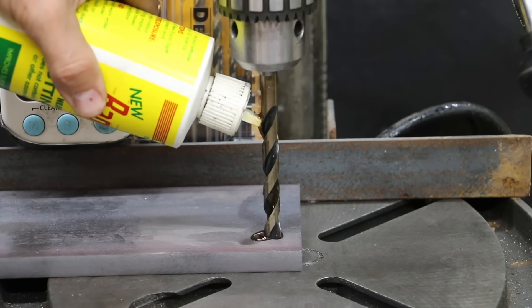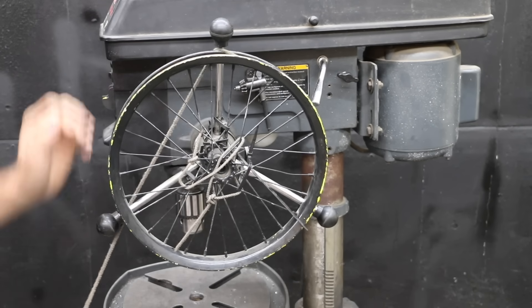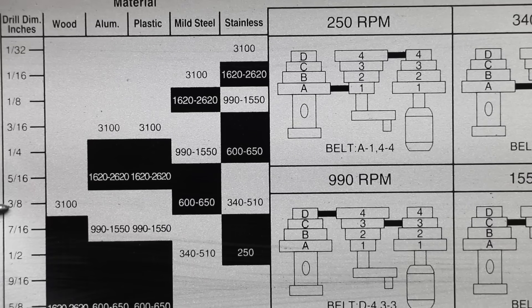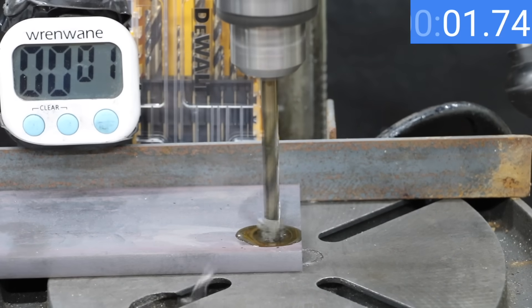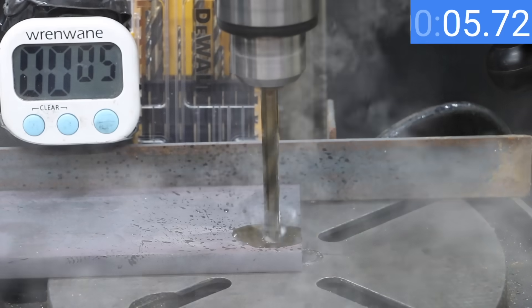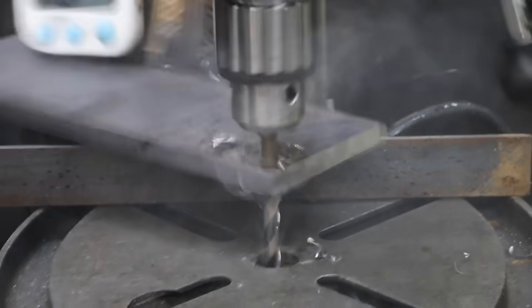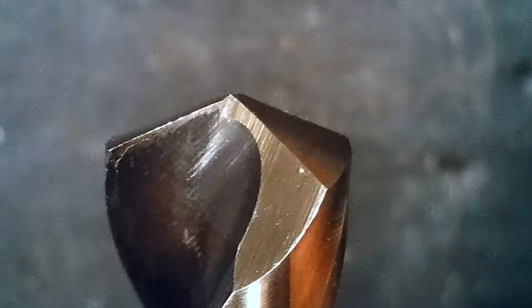I'll use cutting oil to help protect the drill bits. I've attached a wheel to the lever arms of the half-horsepower drill press. At 20 pounds, the weight on the pulley works out to be very close to 175 pounds of downward force on the drill bit. According to the drill press's speed chart, we'll set the RPM to 600 for the 3/8-inch or 9.5-millimeter drill bits. The DeWalt performed extremely well in a previous review three years ago, and this time the DeWalt is once again making very quick work of the half-inch mild steel, finishing in only 10.53 seconds. A look under the microscope and the DeWalt still looks as good as new.